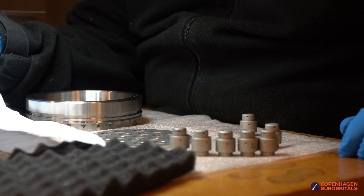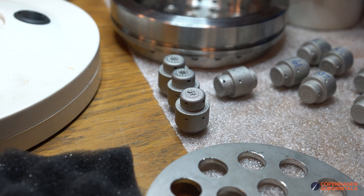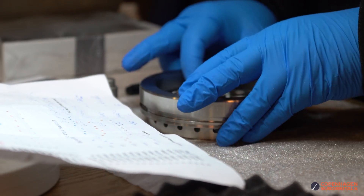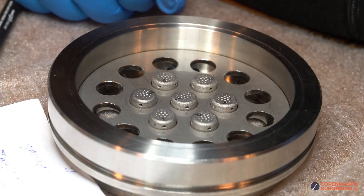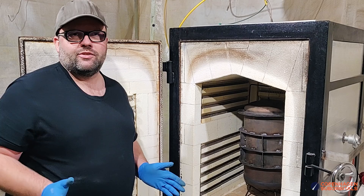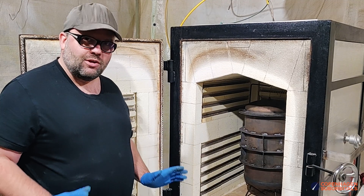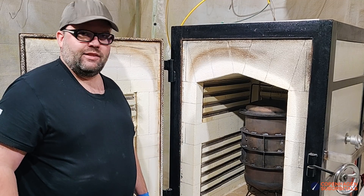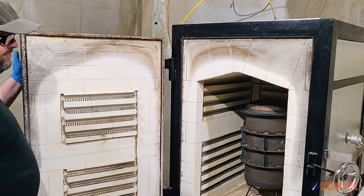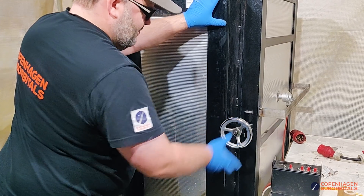This one is pretty much ready to go into the ceramics oven for final soldering now - let's see how it turns out. We've got the first of our injectors all pasted up with silver paste, it's in the vacuum chamber, and all we need to do now is close it up and start the ceramics oven. Hopefully we'll have a perfect brand new injector in a few hours. We'll go over the results of our first injector brazing in our next episode, so be sure to subscribe. But in the meanwhile, let's rewind back and talk about how we got to this point.